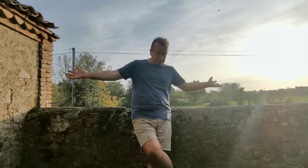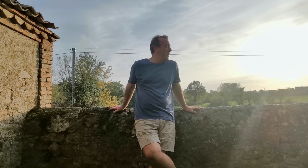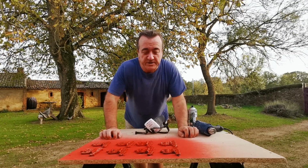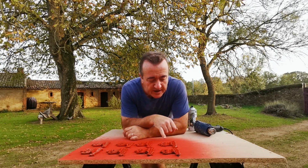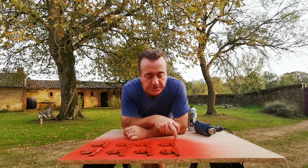It's beautiful. T-shirt weather. Susie wants her hinges painted gold. So it's such a lovely evening. Before it gets dark, I'm going to quickly give them a spray. Right, Susie wants her hinges painted, so I've prepped them up, I've degreased them, I've keyed them with some wire wool, degreased them, dried them. I've put a few nails underneath because I wanted to raise them off the board.